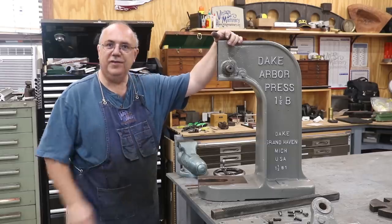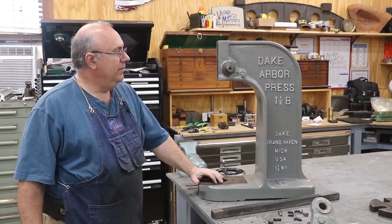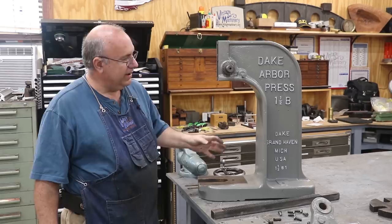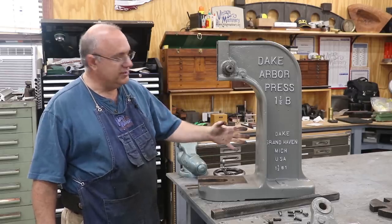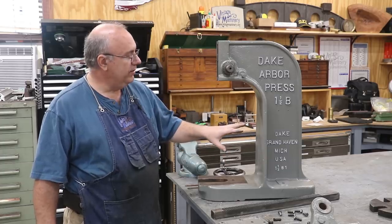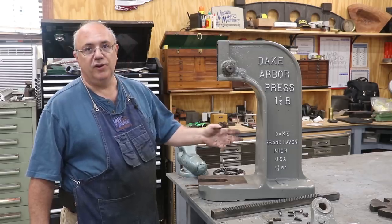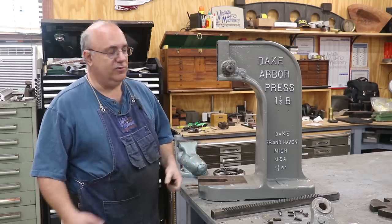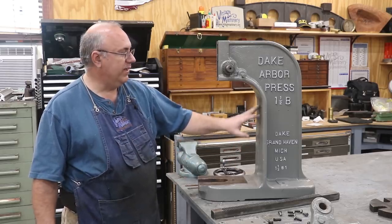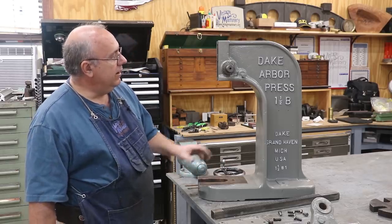We took all the castings and I did this off camera — you guys don't want to see me stripping paint off and repainting. The process we used: I first pressure washed it, just cleaned it up. I then put a chemical stripper on here to get any paint off, let that bubble up for a little while using citrus strip, and then hit it with the pressure washer again to knock that off. From there it was to an angle grinder with a wire wheel to get anything else cleaned off — any rust, little bits of paint, whatever. From there it got painted.